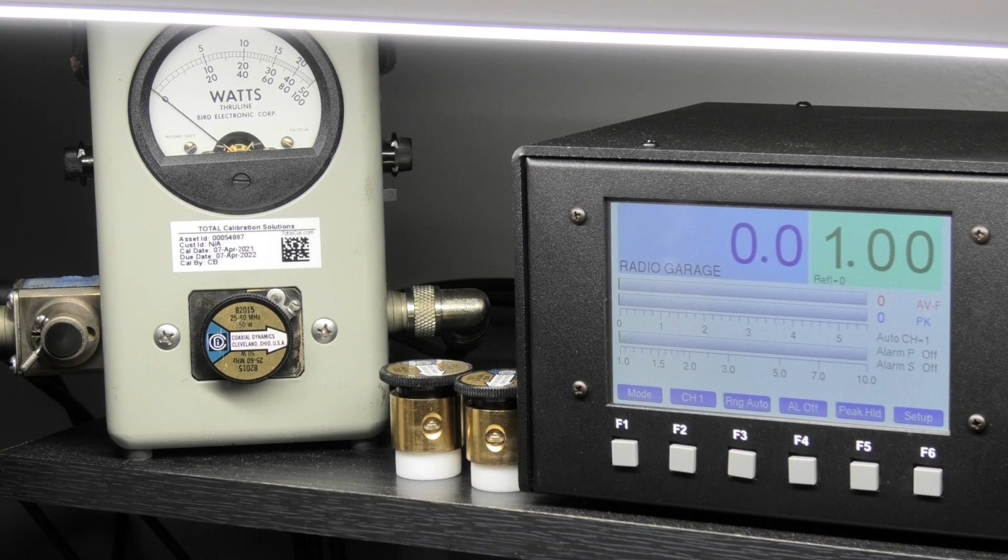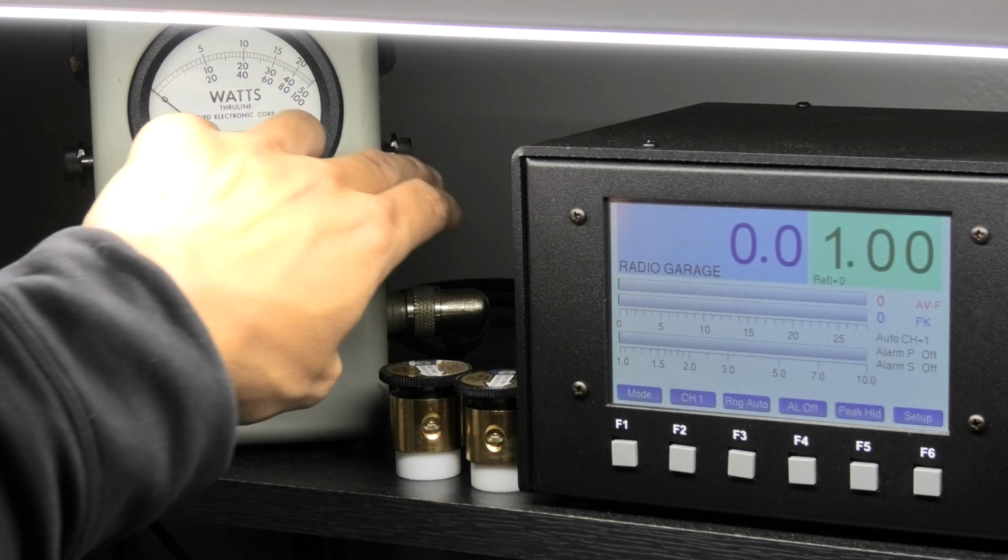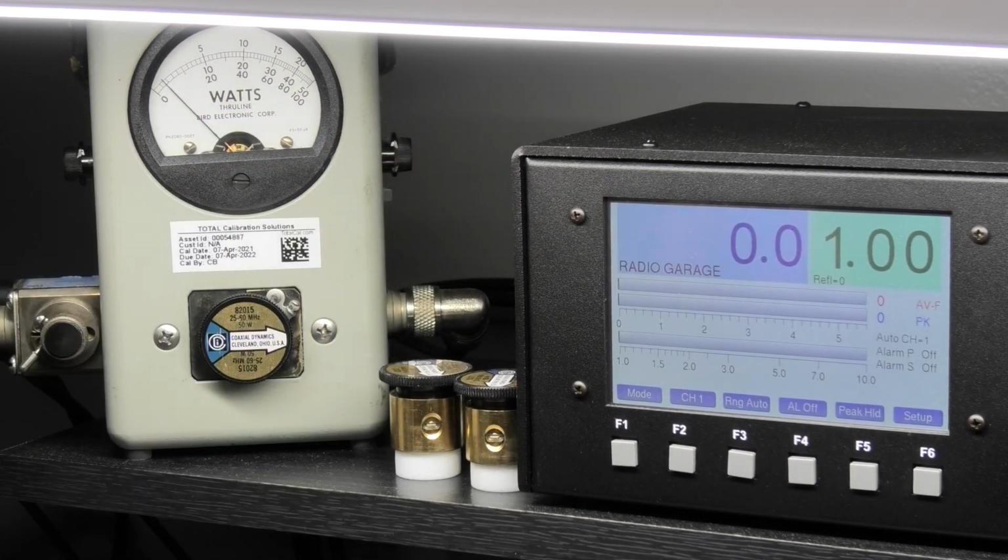Alright, show you average swing. She's got a good little average swing on her. Got a full 6 watts out of it. That's great. That's really great for one of these. Show you peak. Yeah, that's going to drive your amplifier beautifully. Audio check. Audio check. 1, 2, 3, 4, 5. Audio check. Cobra 2000. Cobra 2K. 19 watts. Both meters are agreeing.